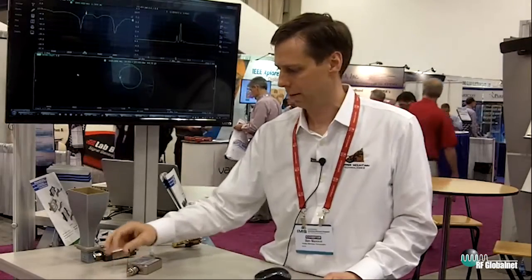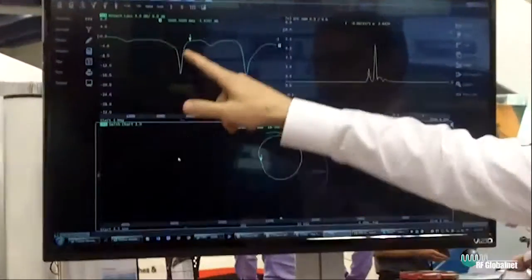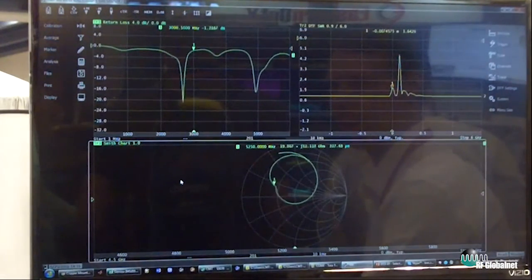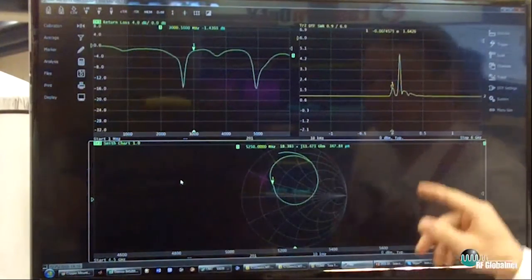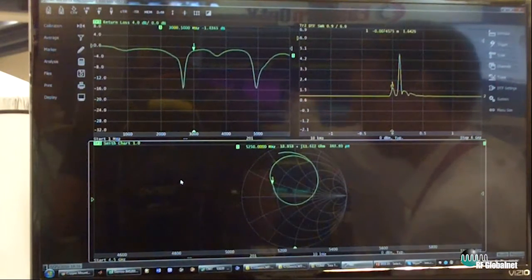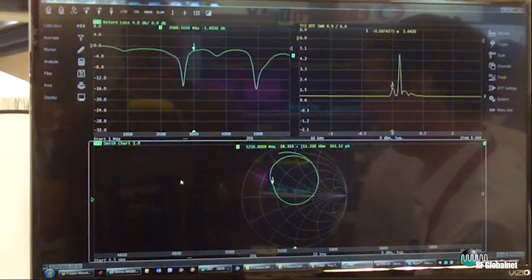What we have it doing here is testing an ultra miniature antenna with a U.FL connector. You can see on the display its return loss. This particular antenna has a sweet spot at around 2.5 GHz and another one around 5 GHz. As I move my hand closer to the antenna you can see that changing — and that's basically the same effect that occurs when you put the antenna into the housing of a finished product. We can optimize this match at these particular frequencies by adding components to improve the match, then verify it's working as expected using a vector reflectometer like this R60.